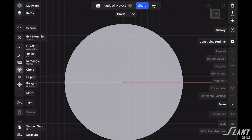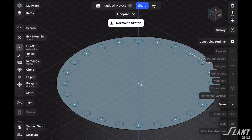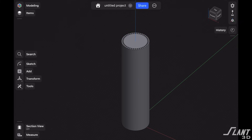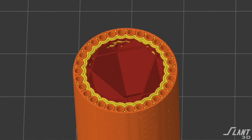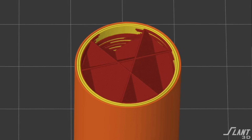It's a little bit of a hack. What you do is you can actually embed a pattern — basically a bunch of holes around the outer part of the part. For example, with this rod, I just put a bunch of circles around the outer edge and cut holes through it. What you've now done is thicken the walls of the entire part, because now there is more material around the outer edges — you're filling in the walls rather than simply having the infill go out to the outer skin and then coming back.